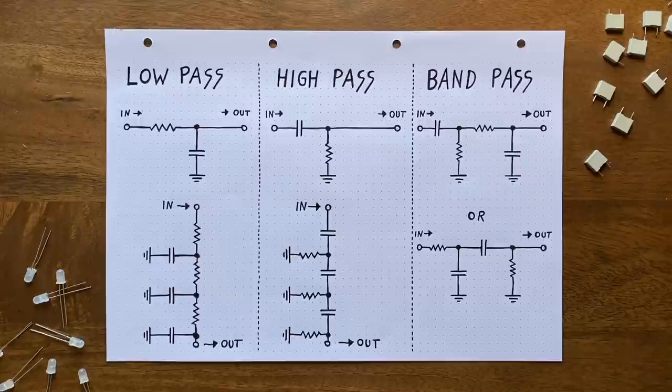Let's move on to the bandpass option then. As I mentioned earlier, we haven't touched on this filter type in my videos before, but thankfully it's not all that complicated. While a low-pass filter removes the high and above, and a high-pass filter removes the low and below the set cutoff point, a bandpass does both of those things simultaneously. It will basically only let the frequencies around the cutoff point pass through.